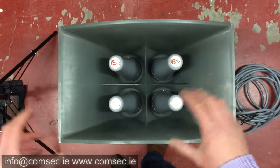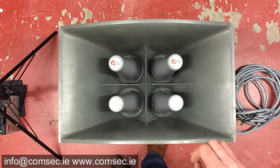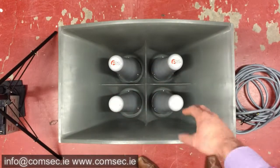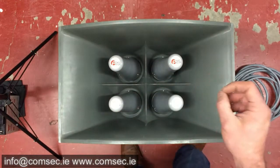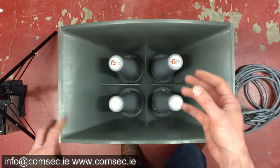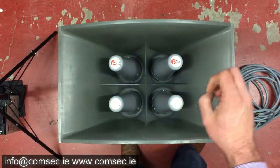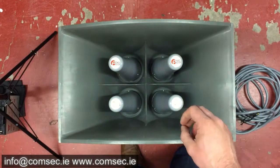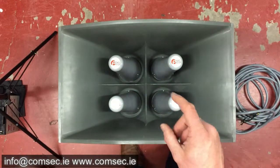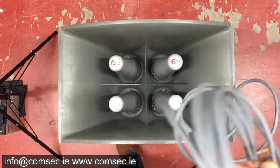These are used to alert the community at large, or occasionally we install them as a wide area sounder within a petrochemical or pharmaceutical plant. There are four 100-watt sounder outputs, and together those four will generate 141 decibels. There are around 50 user-selectable sounds, which are configured in the control panel — I'll cover that in a separate video.